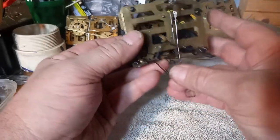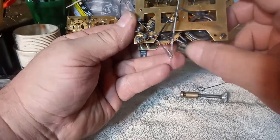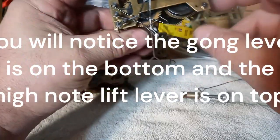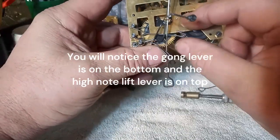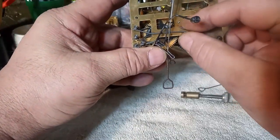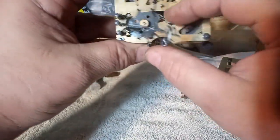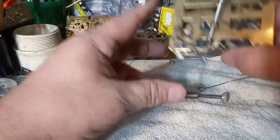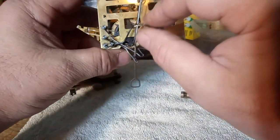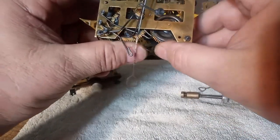Here's an AMS movement. The way the AMS movement works: the gong goes off. On this AMS movement, the high note lift lever is on top, where typically the gong is on top, then the low note lift lever — which is the short lever — and the high note lift lever is on the bottom. But with AMS movements, the gong is on the bottom, the high note lift lever is on top, and the low note lift lever is in the middle.